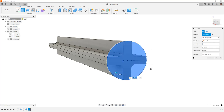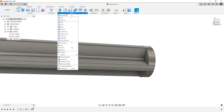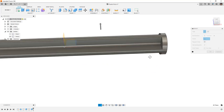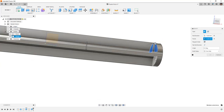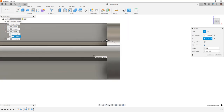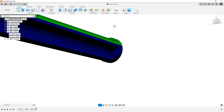We're going to mirror these arcs and projected pieces to the other side — the mirror line will be the horizontal line. I'll select everything and extrude this out two millimeters and join it. Once joined, I'll go back to the draft tool. The draft pull direction will be the midplane — I'll hold down the left mouse button, select XY, and pick these faces. We'll set this at one degree. Notice it's putting both in the same direction, so we need to do two sides — positive one degree in each direction — and that should give us enough draft on those faces. We can turn our analysis on and confirm that the faces are green on top and blue on the bottom.